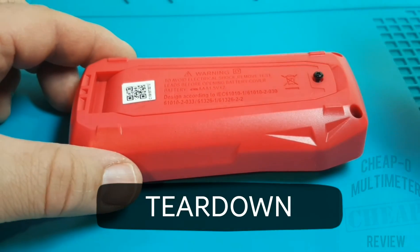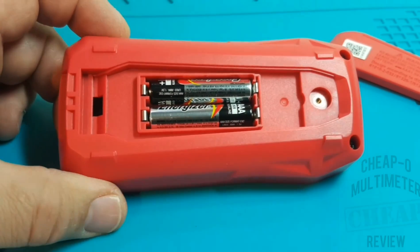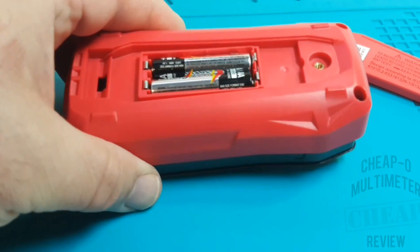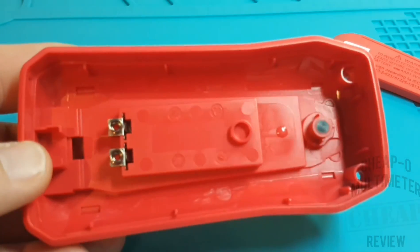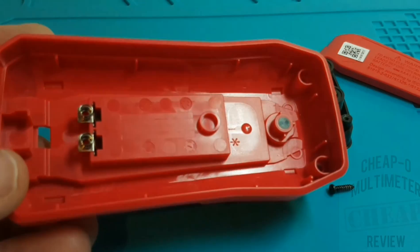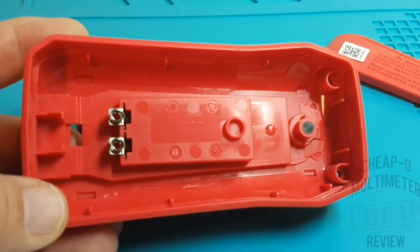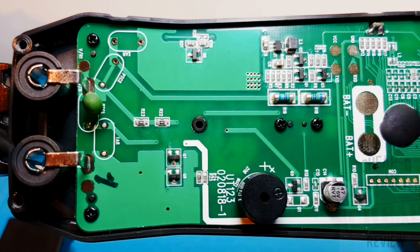Let's take a look at the inside, starting with the battery compartment - one Phillips screw, one nice threaded insert, and access to two AAA batteries. Looking at the interior back of the chassis - no shielding. Come on guys, a little bit of shielding goes a long way. The input jacks are decently soldered, go right through the PCB, are of the split variety, and have added support via extrusions on the back of the chassis.